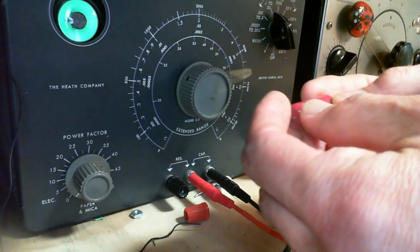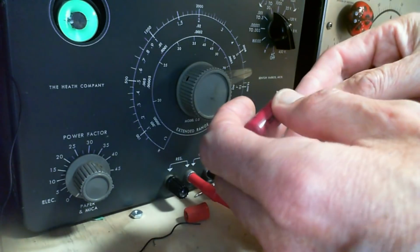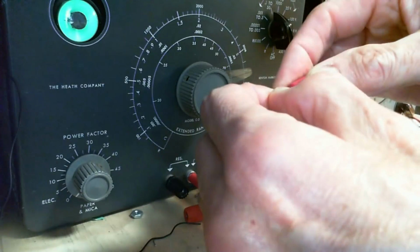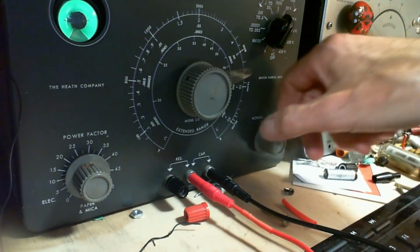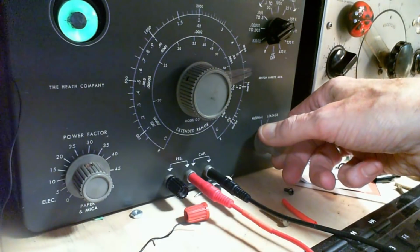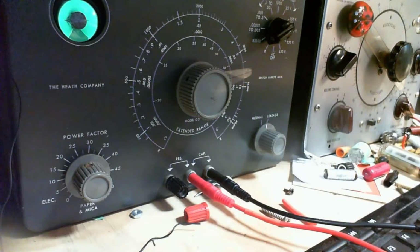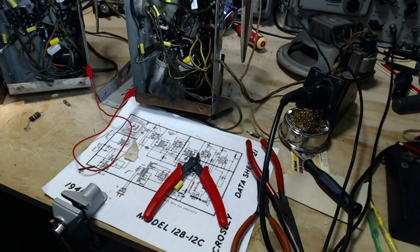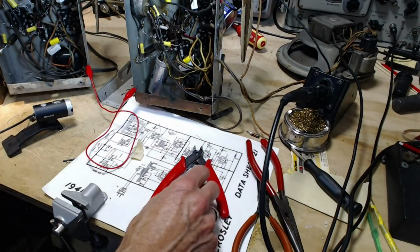Okay, now the other single Sangamo capacitor, 0.05, where it should have been a 0.02. Probably didn't make any difference. Well, let's see. Okay, 25 volts. Not going to open. So we're all tired capacitors, no surprise. Enough to bring down the operation of the radio? Well, I'm sure it's not helpful. In some circumstances, yes, a little leak onto a grid or something like that, yes. But in other circumstances, no. A leak doesn't really amount to anything.